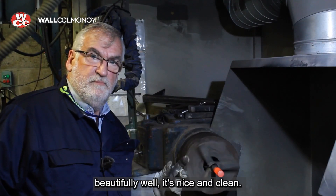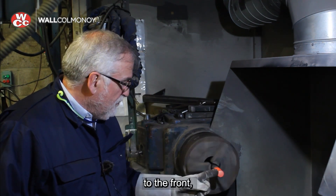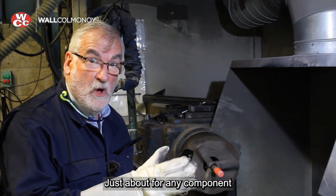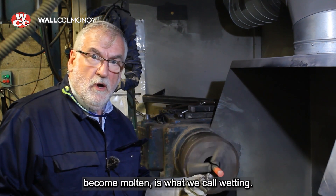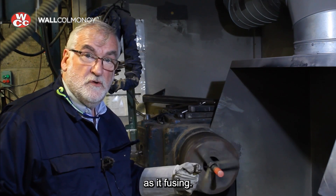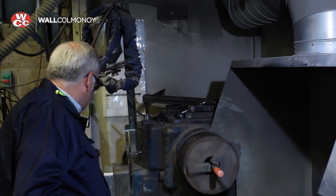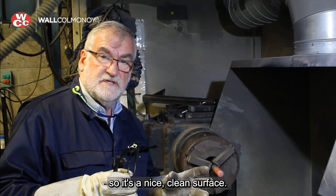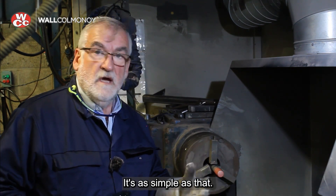That's fused out beautifully — nice and clean, I can see no issues with that whatsoever. I fused all the way around to the front including the nose, just like you'd have to do on the plug. That's it — it's the same process for just about any component you want to spray. All we did during the fusing was take the temperature up until we could see the powder become molten — what we call wetting — and it does look very wet. You can see the reflection of the torch in the surface of the coating as it's fusing, and we work it all the way along. Now we'll let it cool down, take it up to the machine shop, have the machinist skim the outside to a nice clean surface, check the hardness, and we'll bring you the finished results a little later on.